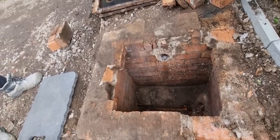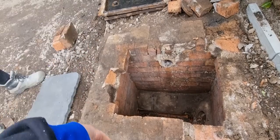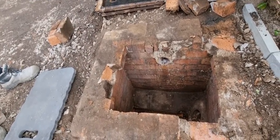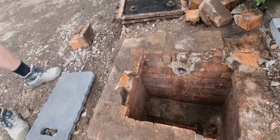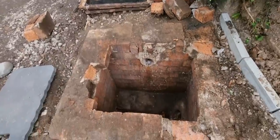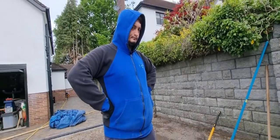So what we're going to do is buy two pre-stressed concrete lintels and put them across there. That'll take all the corbelling out of it and all the time that takes, and then we can just put our new chamber cover on, which is over there just to the side of Brad. We can stick that on to the right levels. So you're the man for the job, Brad.